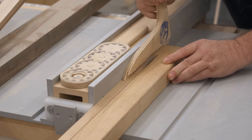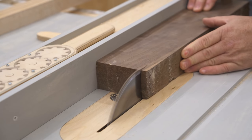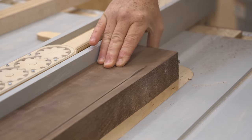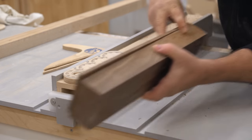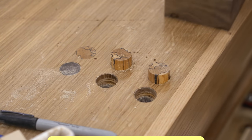This organizer can be built with any type of wood, but I'm going to use walnut to make it extra fancy, and that'll be for the case that wraps around the drawers. The top and bottom will be quarter-inch thick, and that's what I'm cutting right here. Before making the next cut, I need to flatten the side I just cut so that it doesn't have any ridges.